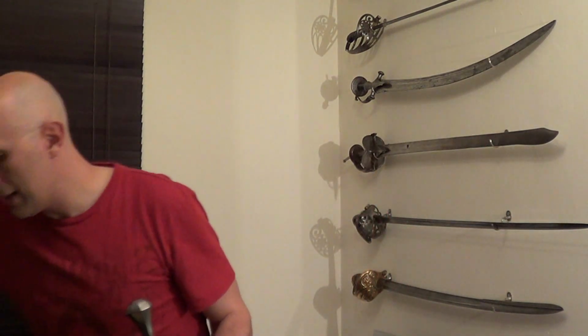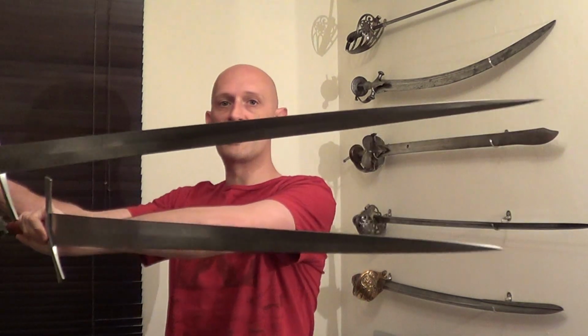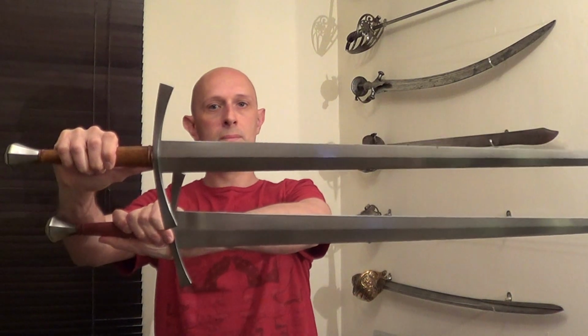One curious feature in regards to distal taper with these blades is that very often this type of blade that's very broad at the base and pointy tipped, and I could give the Albion Ringeck as another example. It's essentially a very, very similar blade type, almost the same blade type, just slightly not quite as broad but a bit longer. They very often have almost no distal taper.